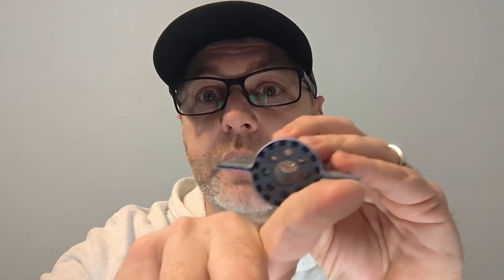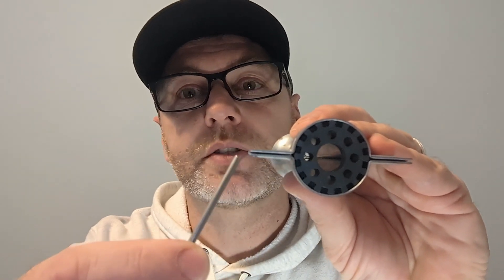What it does is when the flame comes out of the main part of that burner, you actually have a little bit of gas that travels down that channel and you'll have a teeny tiny flame there. But that flame is able to run across and jump to the next burner, lights that burner, lights the next one, and on until they're all lit. Because a lot of times when those burners start rusting and the crossover channels themselves rust, well that igniter actually only sits in front of the first burner.